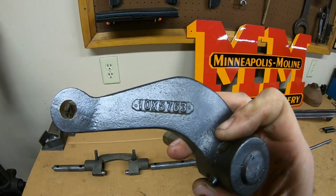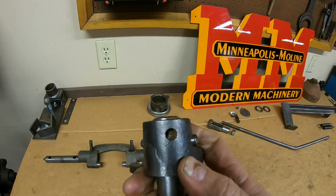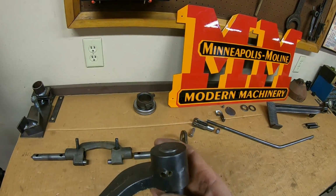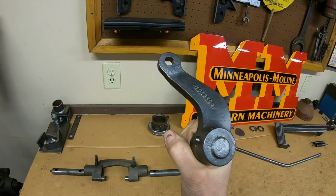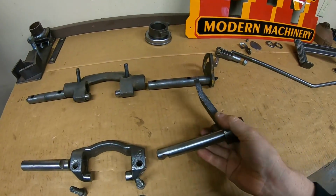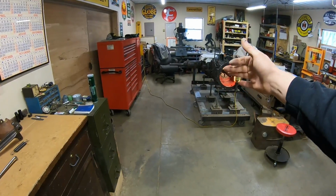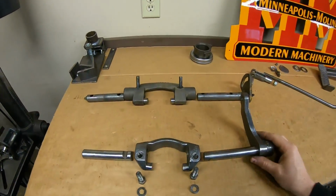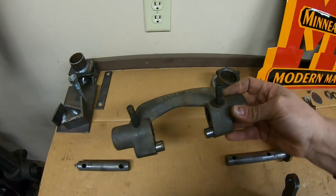This lever is a 10X 5763, and you can tell there's a lot of extra holes in it. We've got 2 slightly misaligned holes there, and on the other side, then finally a roll pin through that. They had this lever clocked differently in relation to the shaft at one point in time, and I believe that was due to a design change because we know from the archive photos there was a lot more going on with this clutch linkage, I believe as a part of a first generation Ampli-Torque high-low range than what we have now.